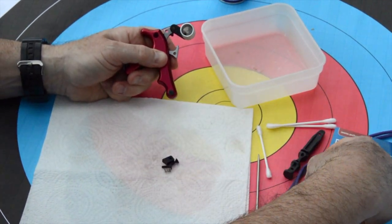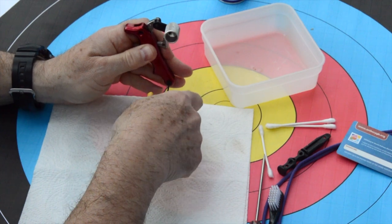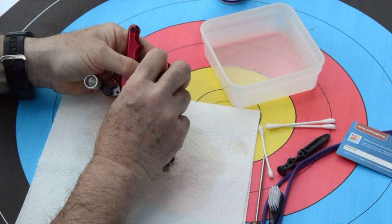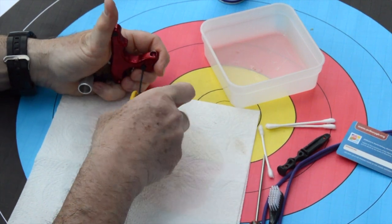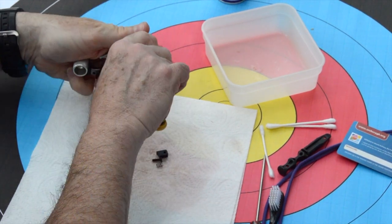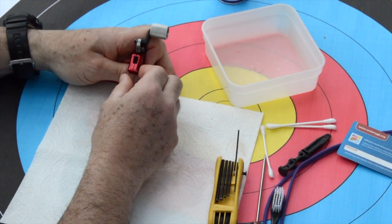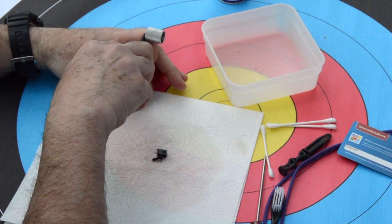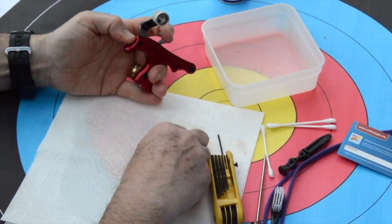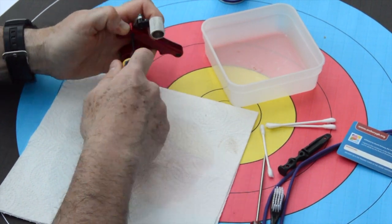Now we can reattach the top case, keeping everything close in — I don't want this to spring apart at this point. Do up the two screws that are effectively holding the case together, pulling those up gently but firmly. And on this one the spring goes in — make sure it sits down in the hole and doesn't go sideways, as you can sometimes do with the Target 3. Put the plug in the right way around, hold that in with my thumb, and then the retaining screw for that.